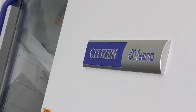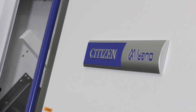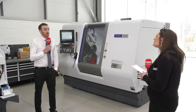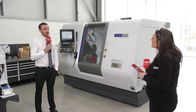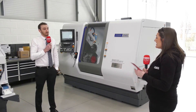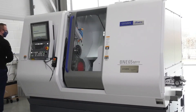And obviously you said listening to your customers — they'll be amazed that you've managed to do this. In relation to the Miyano standards, how does this keep up? I think we've even surpassed our own standards, to be honest. This machine in particular has over 100 hours of hand scraping just on the slideways. That is huge — having that handcrafting in the machine is a huge advantage.